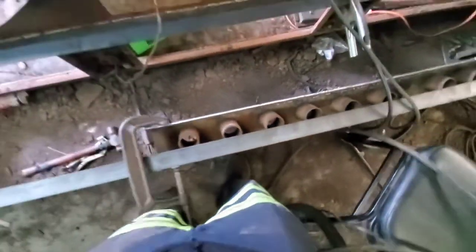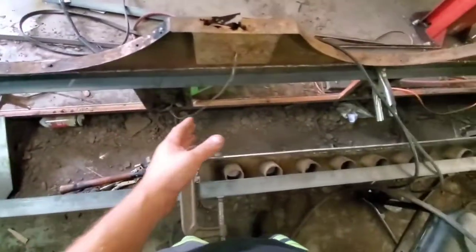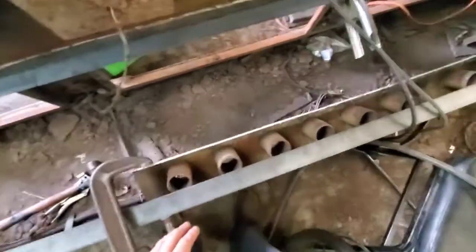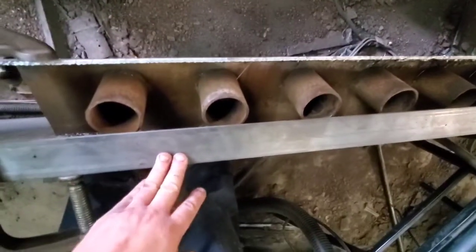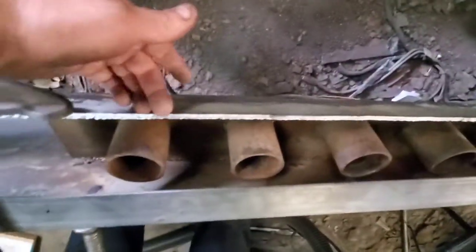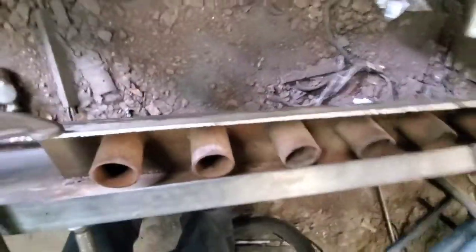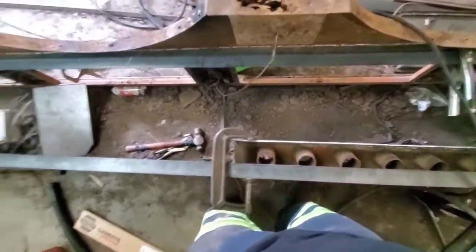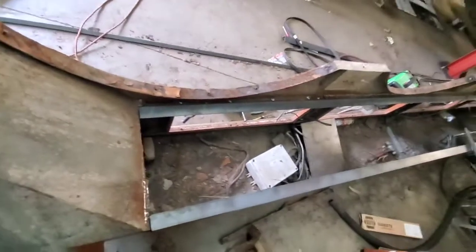So the next order of business is to cut our entire floor out. It's going to be an 8-foot section and then a 6-foot section over there. We're gonna tack weld it to our angle iron, and then once we flip the box over, we will mate the floor to this piece here. So yeah, in a few minutes I'm trying to get a bunch of my cuts done now. We're gonna address this little corner here, and stay tuned.